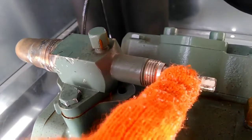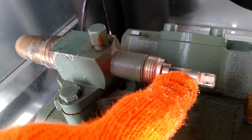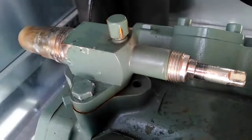This is a discharge service valve. It's got a valve stem and a packing nut with a packing gland inside. This stem is fully back-seated — it's all the way out, meaning the valve inside is open to the system and the service port is closed.